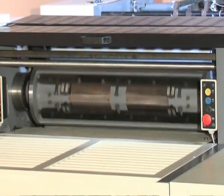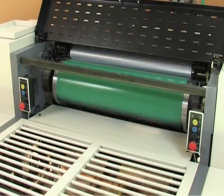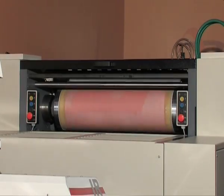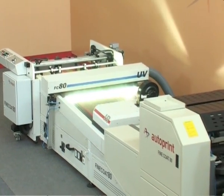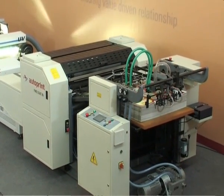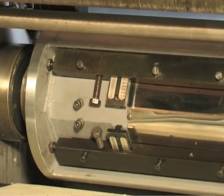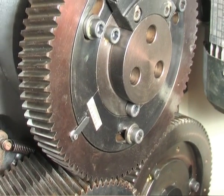The machine consists of two cylinders — a plate cylinder and an impression cylinder. In the plate cylinder, blankets are used for flood coating, while photopolymer plates are used during spot coating. Apart from flood and spot coating, the Fine Coat-80 can also perform spot knock coating using strippable blankets. The circumferential movement of the plate cylinder and skewing of plates are possible in the Fine Coat-80, enabling precise register of the coating over the printed substrate.